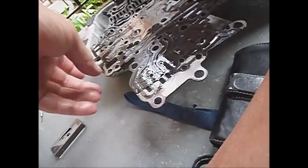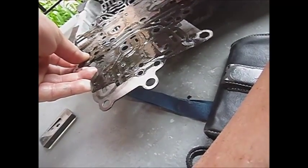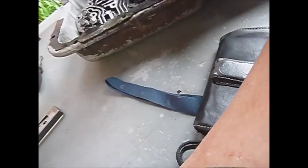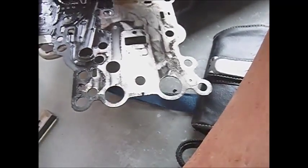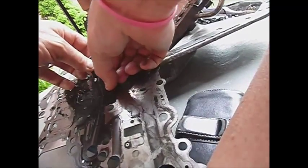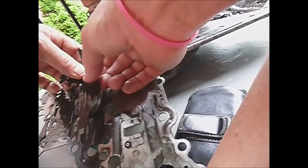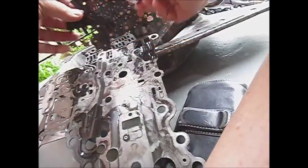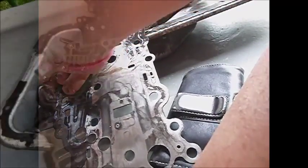This slide is fighting me every inch of the way, and picking off these baked-on gaskets is not particularly fun. If you have a cleaning machine that can boil the stuff off, that's much better. Otherwise it's pick, pick, pick away at it — very carefully, without gouging. A straight and flat pulling motion gives you a lot of bite pulling the stuff off when it's baked on. Sometimes it's just scraping and chipping off little bits and pieces. It just takes patience.